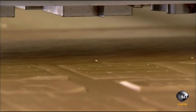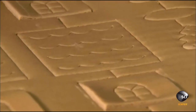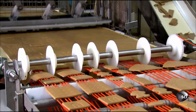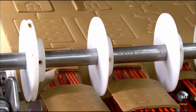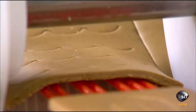A large cookie cutter swoops down, propelled by compressed air. It punches out various shapes, producing gingerbread cookies that will fit together to form a house. The cookie cutouts land on moving rubber-coated wires. Separators between the wires knock off the excess gingerbread dough to be captured and mixed into the next batch.